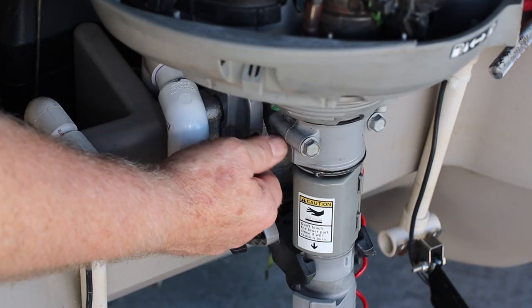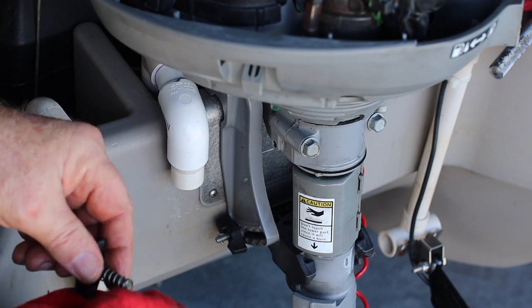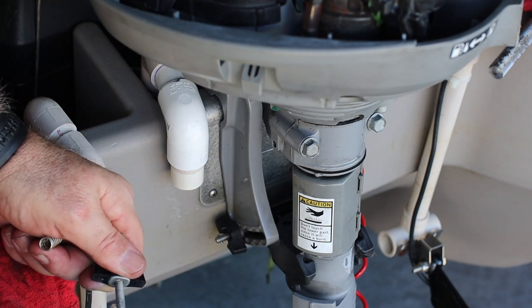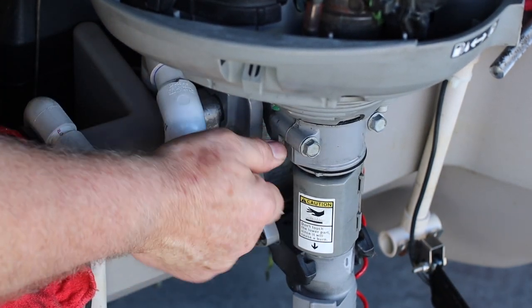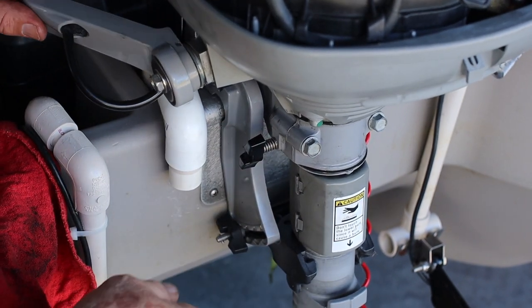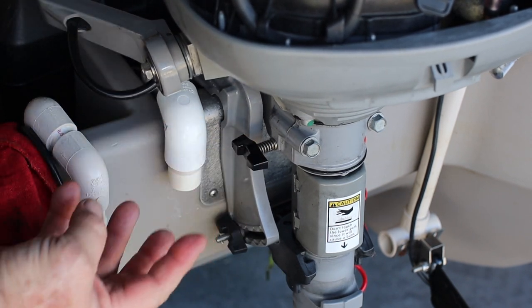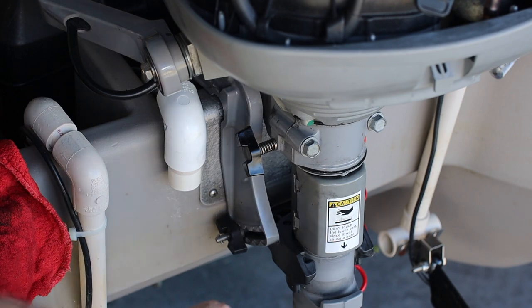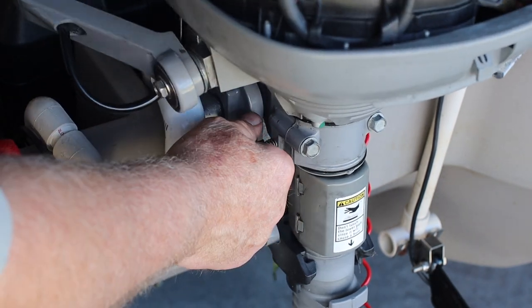This is called the steering friction bolt. I'm going to take it all the way out, clean off the surface and everything around it — there's a spring. You can see all the grease on there from last time. I'm going to again use the Super Lube, just getting it in the threads. This puts tension on the shaft so that this does not turn as easily. If I tighten this up a little it's hard to turn; if I loosen it up it's very easy to turn. This makes me nervous because it could easily vibrate out and plop into the water and it's gone. Six years and I haven't lost it yet. Right about there seems good.